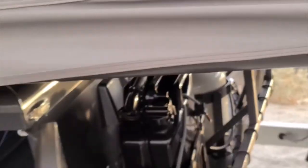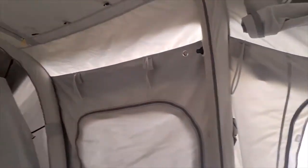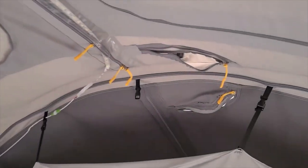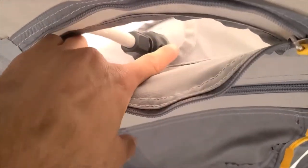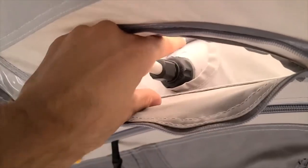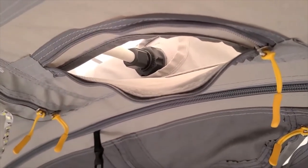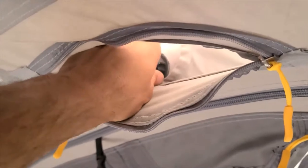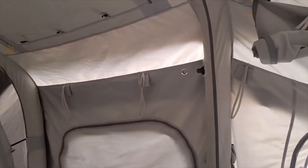We've got some extra water and some propane up front. So these are the airframes — there's one, another one back there, one right here in the middle, and two more on that side. What I really want to show you is the valving system. You can shut this off right now — all the frames are connected, but you can shut any one off just in case another frame goes limp. If you actually pop one somehow, which I think is almost impossible, you can isolate that frame that's going down and keep the rest of them up.